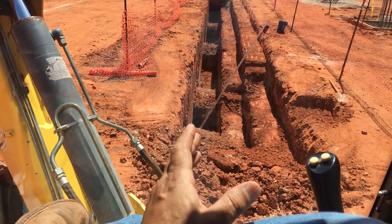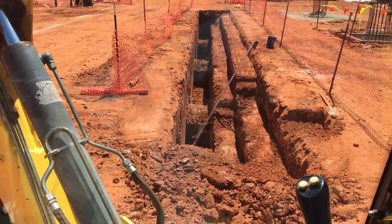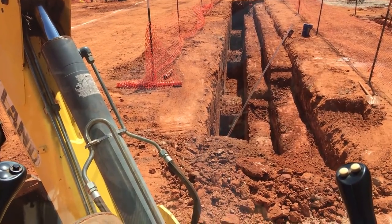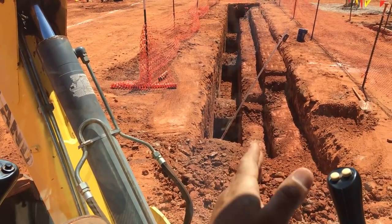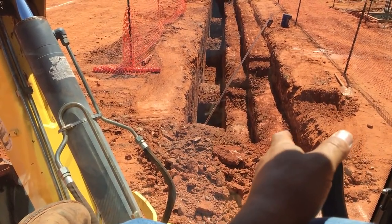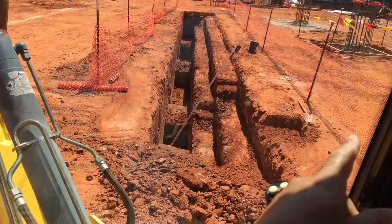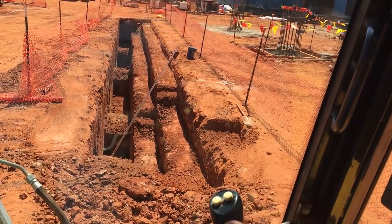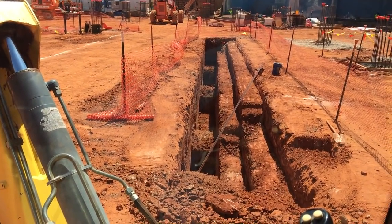And they're happy with it. It varies probably an inch and a half in places, but for what they're doing and the size of this pit, it's going to be fine. They could probably save a little bit of concrete by forming it, but then after they form it, they have to put the waterproofing over the forms, and they have to overdig the hole. And in this situation, if we actually overdug this hole, they wouldn't be able to get any traffic in here once it's dug out. So they still will be able to get around this one side with their Bobcats and smaller equipment.